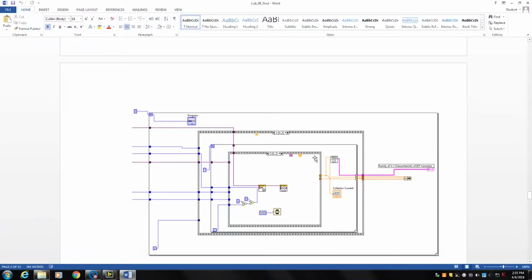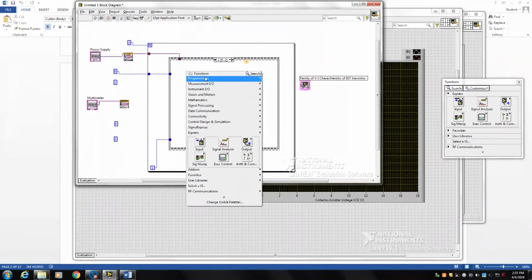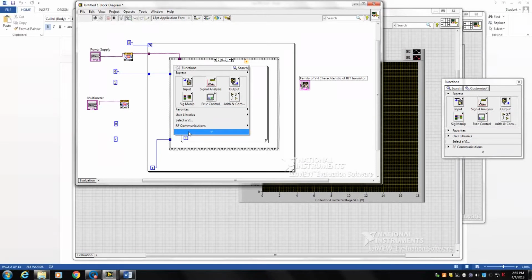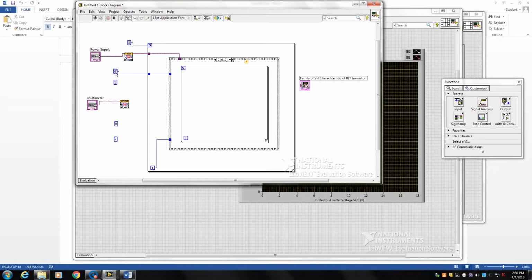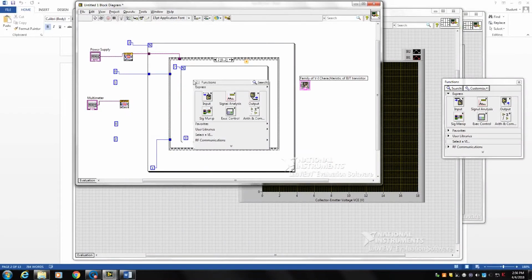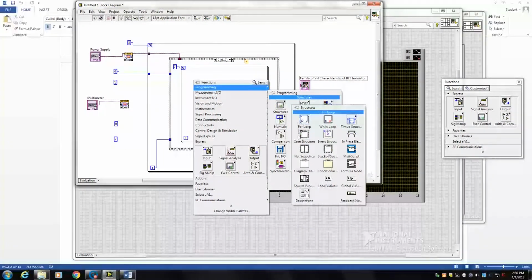So again, I defined a for loop. I want to sweep the voltage from 0 volt across collector and emitter, and then I want to set the voltage and set the step size. In each iteration I increase the voltage, let's say by 2 volt, 3 volt, whatever you want based on the lab manual. Then inside that for loop, in each iteration again I have a first frame, in which I specify the voltage that is provided by the power supply. Then I pass it to the power supply. Then I measure the current passed through the collector based on that voltage.